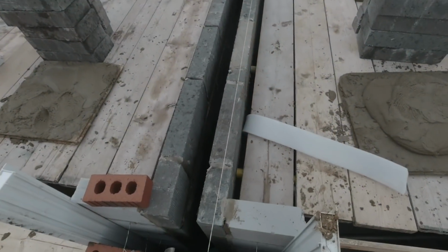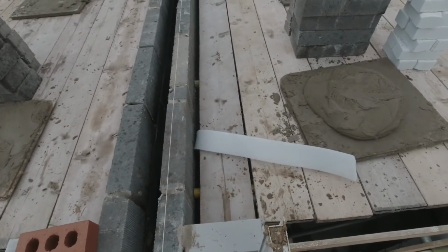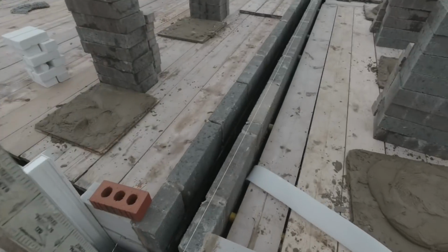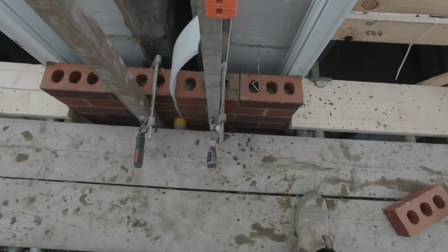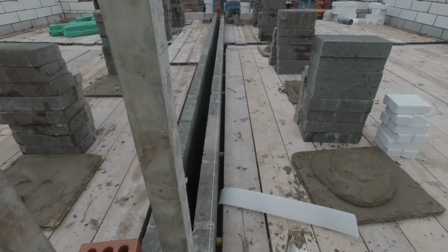What we are going to do now is get some jack walls in. Got our lintels up here. We're going to get these jack walls in, and then once they're in, we can pull the fronts through. Again, profile set up, intermittent. Clamped on hard down the bottom, levelled. We get it right to these gauge marks as well, and we know we can't be wrong. Lovely.